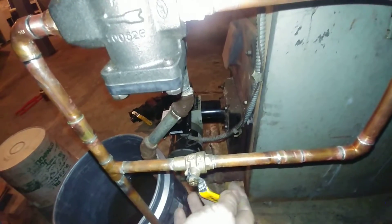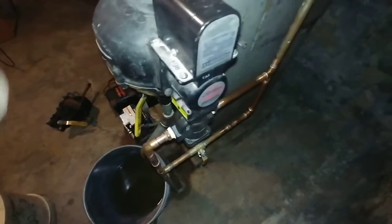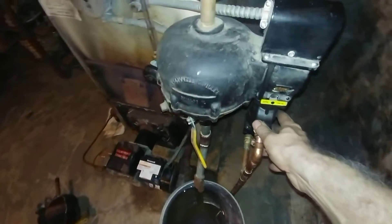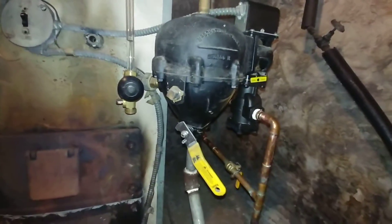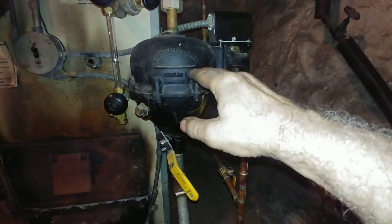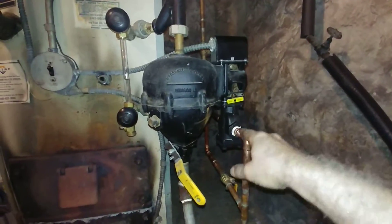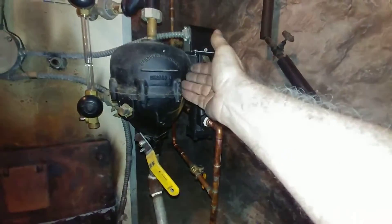This is the bypass there, going down into the boiler. This is the number 2 switch — electronic — and this is the mechanical feed. This was fine for the 1930s, but probably the best use for this really is if you had a crab steamer. As the float drops it'll start feeding water in before it shuts off, to keep producing steam for the crabs, and it'll only shut off if the demand for steam gets beyond what the boiler can produce.